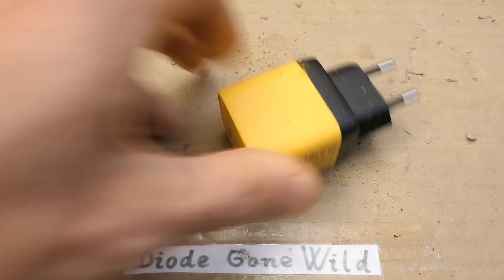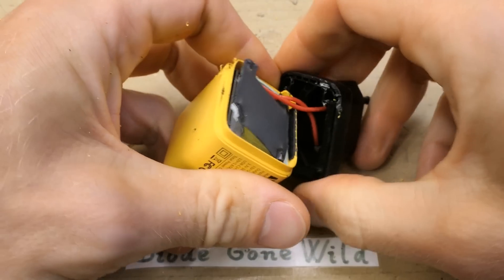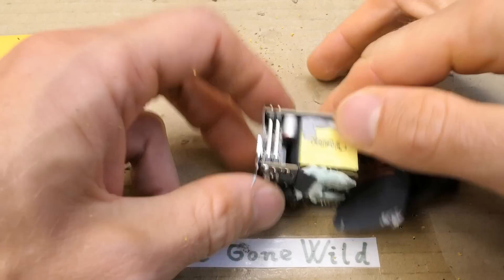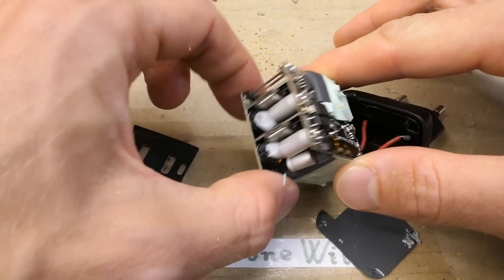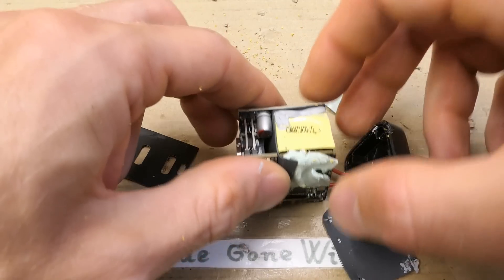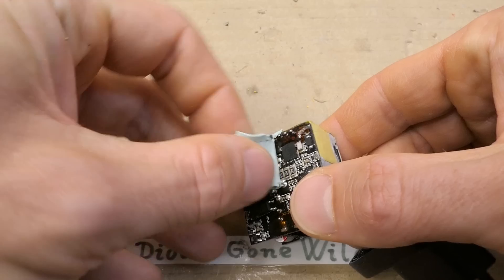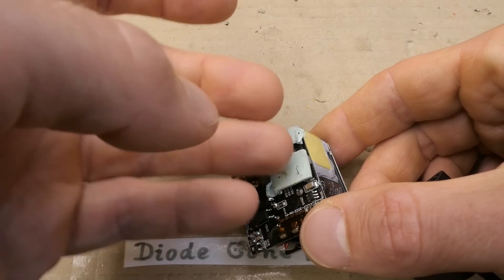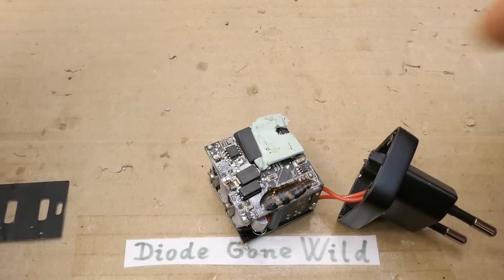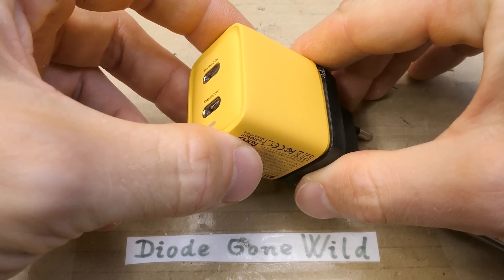But now of course the internals. Can I open it? And that's it — it comes out. It's on two boards. It looks quite convoluted inside. Before further opening it, I should do thermal imaging. If the cover is 111°C, what are the components? Putting it back together, let's run it for a couple of hours and then quickly open it and see the temperature of the internals.